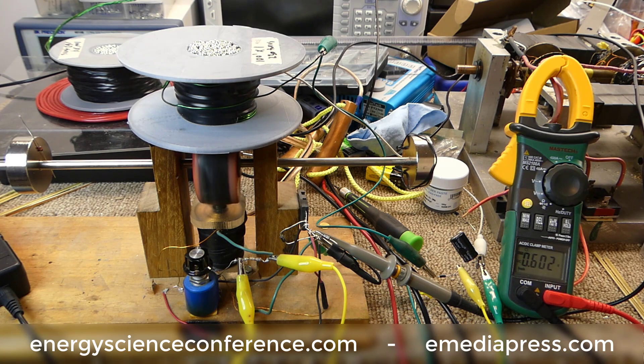We're not going to get much higher than that — maybe 0.7 volts if we sit around for a while. We can look at what the peaks are on the scope. But the capacitor is only getting about 6 tenths of a volt. So now what we're going to do is introduce another element.